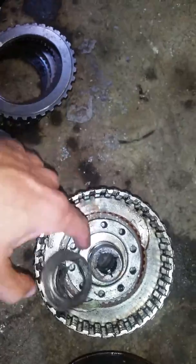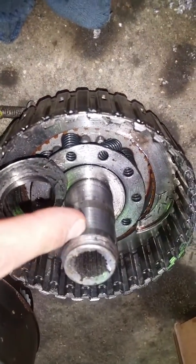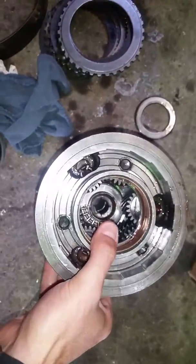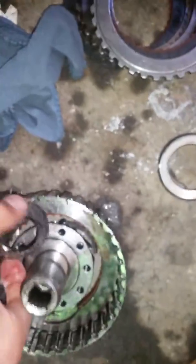The pieces here have eaten out this part of the shaft where it's supposed to sit on the planetary gear system. The system sits here and the bearing had failed there, and the contact point here had worn this shaft out.